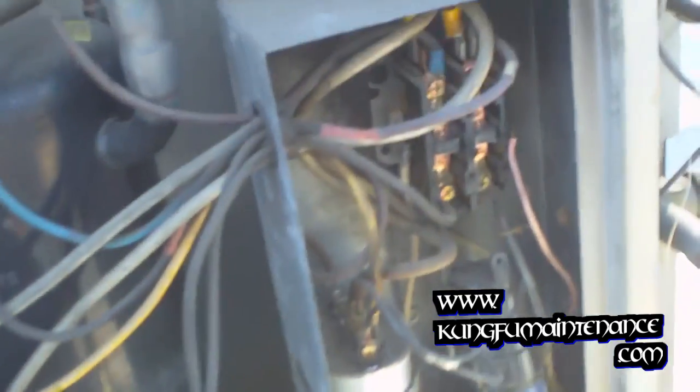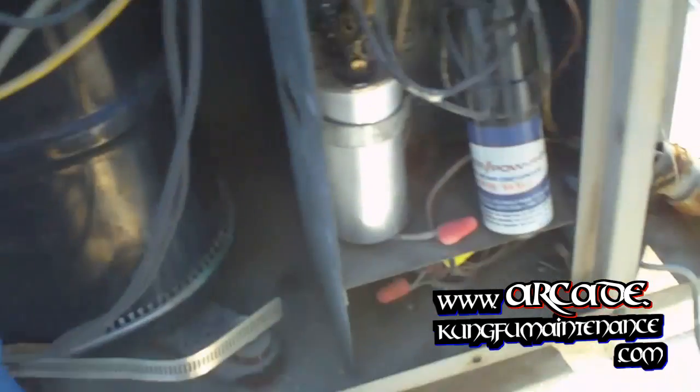This is a dual cap, so it's pretty simple to change out. I'm going to pull my disconnect right here — got my brand new fuses in there — and go ahead and discharge the capacitor. Now when I check the voltage with my circuit alert device, we can change the capacitor safely.